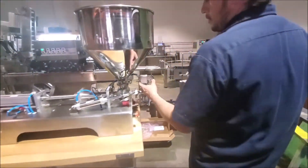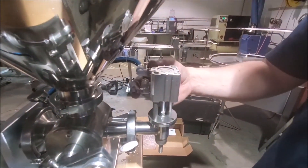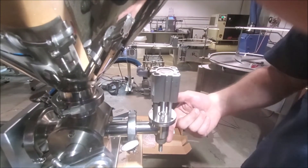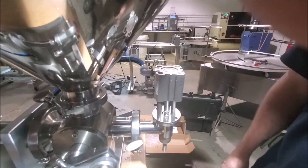On the front side here, we have one more flow control on our nozzle. This is going to control the opening and closing of the nozzle. If you're getting some leaking out of your nozzle when the system is not dispensing, you're probably not getting the nozzle closed quick enough — so we can change how fast or slow we're closing the nozzle.